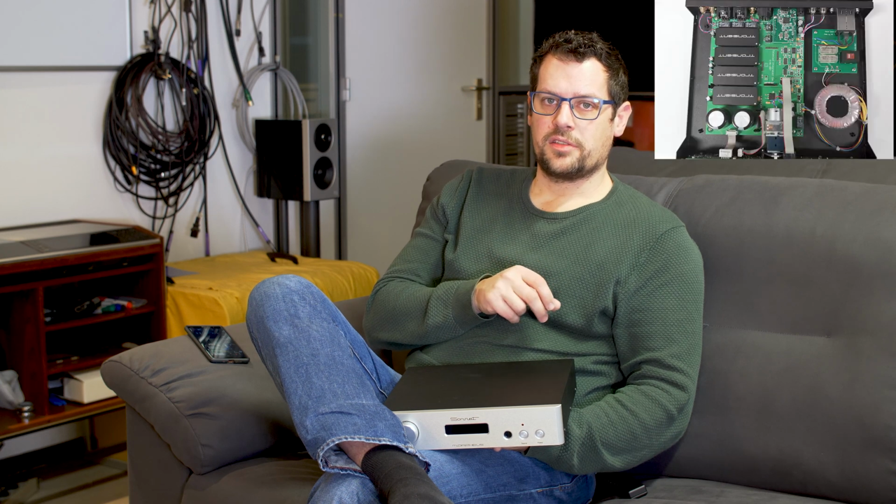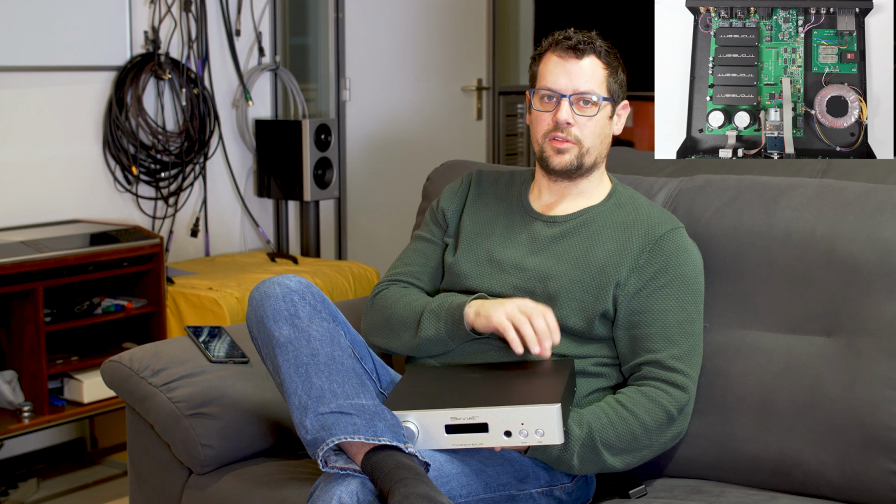If we have to explain his architecture very compactly, then we can say his Metrum Acoustics Adagio and Pavane, all his DACs have own designed DAC chips, the transient DACs. And the latest generation, the DAC 2, has in fact two DAC chips and one FPGA built into one module. Both DAC chips are 16 bits, so you might think, how is he gonna convert 24 bits then? Well, he only uses the first 12 bits per DAC chip. And the FPGA combines the 12 bits into one 24-bit signal.